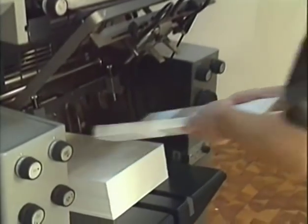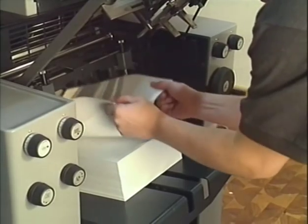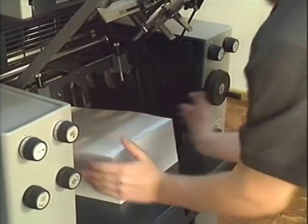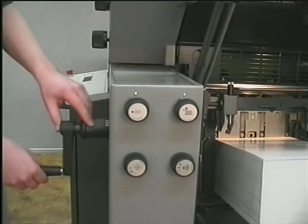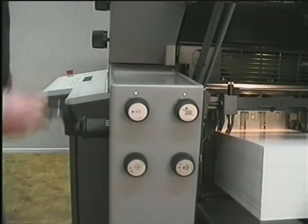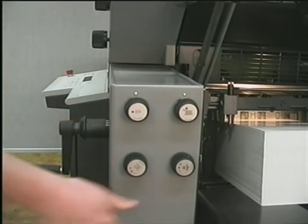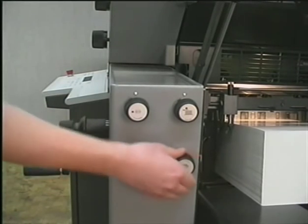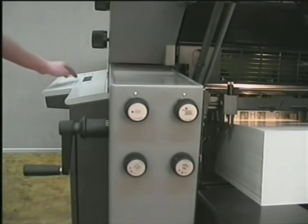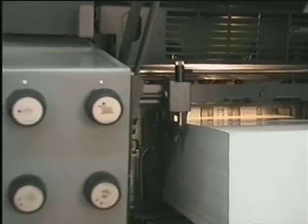You can now pile the paper in the feeder. Then you turn the pile up to the first mark and disengage the crank handle. Now you turn the knob for the pile height counterclockwise to the lowest working height. Once you start the press, the pile transportation will also start automatically. The upper edge of the pile has to be adjusted according to the stock thickness.